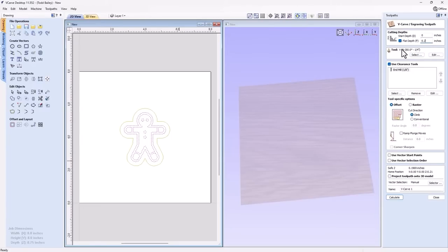We're going to use the 60 degree V bit to do most of the work for us. And we're going to include in a clearance bit. I'm not sure whether or not we're going to need this, but I'm going to put that in there anyway. It will help out in the end if there are any big voids in your inlay,